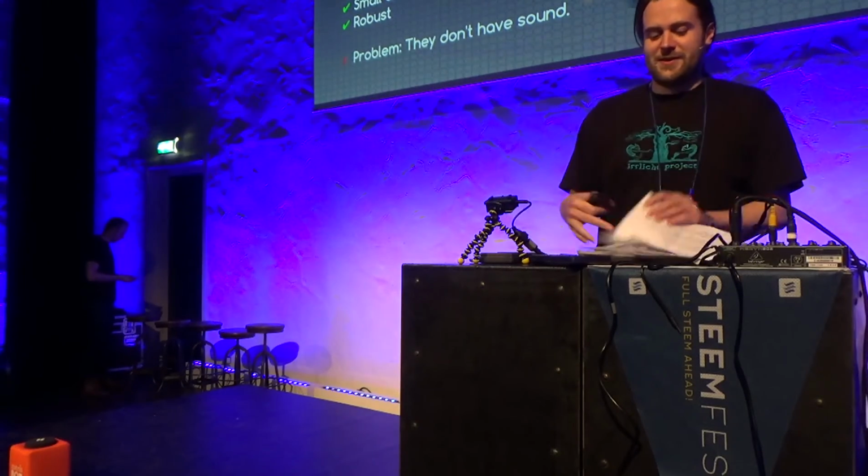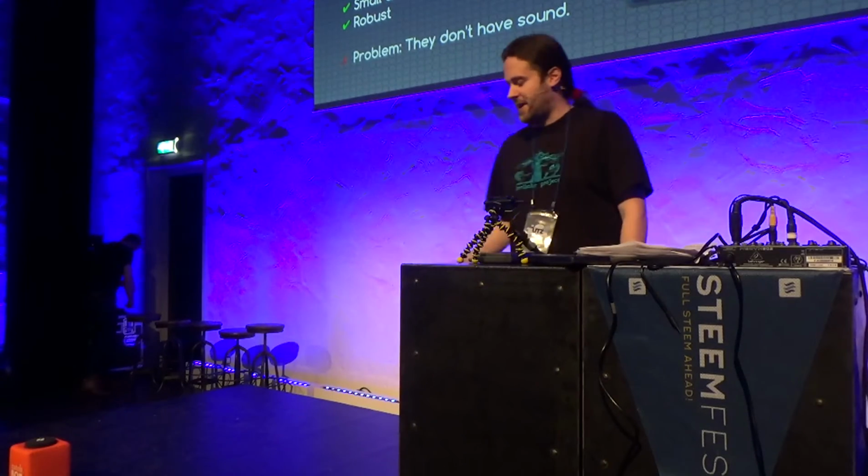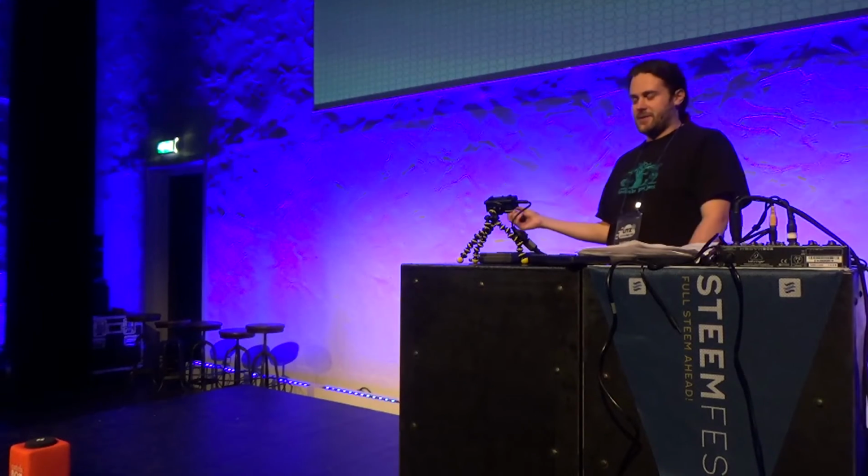So, well, how are we going to do this? What they do have, these calculators in general, is an analog serial I/O. They have a link port, so you can exchange data between calculators or between a calculator and a computer, which is just a serial 1-bit line, or in the case of the Texas Instruments calculators I'm using, a dual 1-bit line.